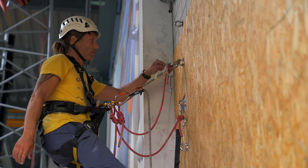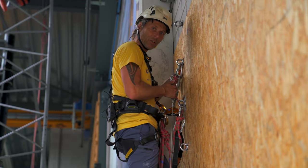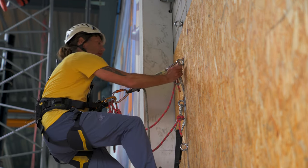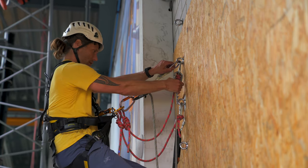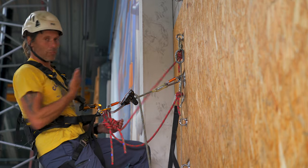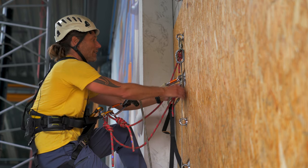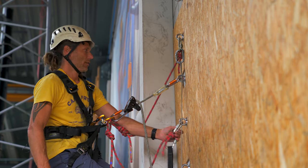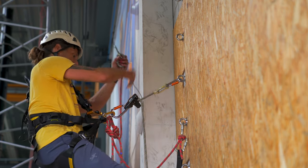Now if I want to take out my positioning lanyard, I have to stand in this foot loop — and if I squeeze the carabiner here it's hard to get out. So that's something that changes: the top one comes down and goes behind the positioning lanyard. I take my positioning lanyard and step down, sit back down — I do it on top because now I'm leaning back into it — and I need to make three points again. Because I'm behind it, it's easy for me to take out. From three back to two — remember, behind — and I do some rope management first.